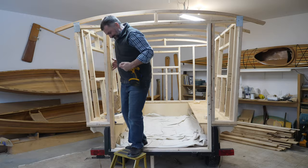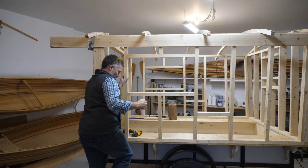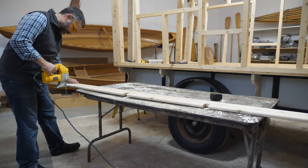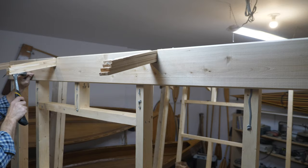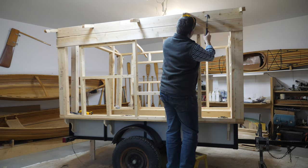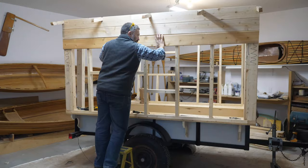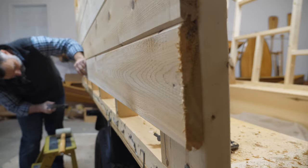With the roof beams in place, it was time to start doing the exterior siding. When deciding how to finish the exterior, I looked at other cottages and cabins for inspiration. I really liked the look of cabins paneled with cedar siding, so I decided to go with that. Cedar was a good choice because it's a lightweight softwood, it has rot-resistant properties, and it's believed to keep away bugs — anything that'll help keep the mosquitoes out is worth trying. I used tongue and groove cedar siding from an Amish wood mill down the road, and the total cost for the exterior walls was about $400.